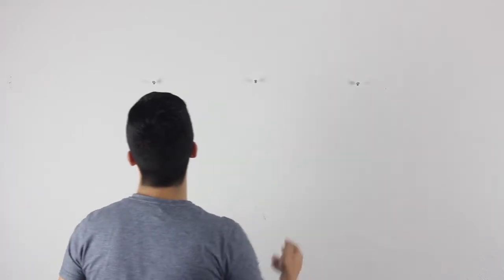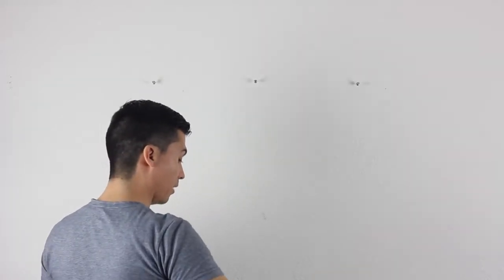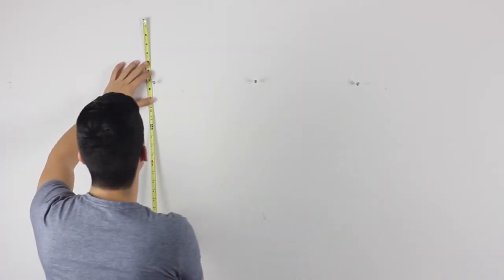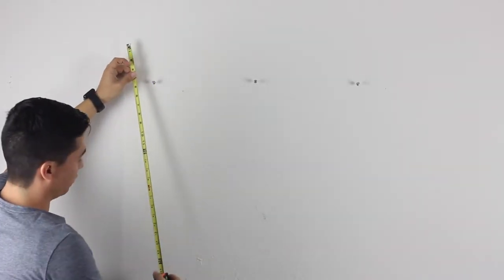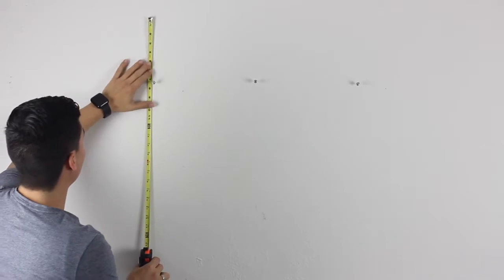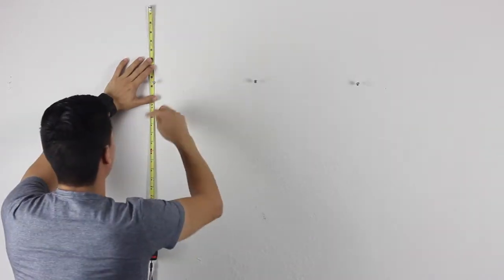Now what I want to find out is how high you want it. The distance down from the top of the arc to the hangers is 8.5. So basically I'm just going to go to my first pin to the left, and my overall is 25.5, so just go ahead and lock it at 25.5. That way you have a better idea of how tall your artwork is. Now I'm going to go 8.5, because that's what the label says, 8.5 from the top to the bottom.